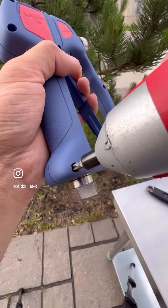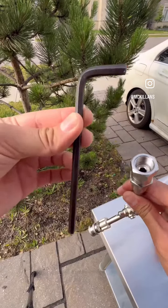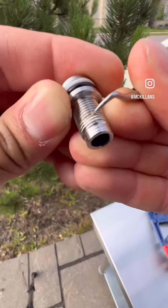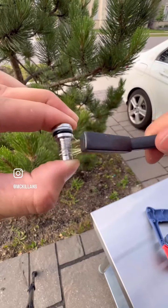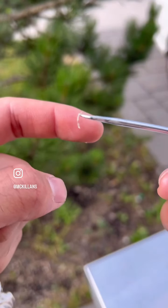To solve this, you'll need a phillips head screwdriver to go under the hood, and now we can disassemble the swivel using a six millimeter allen key and a wrench. Inspect the o-ring on the allen bolt and replace it if necessary. It's important to scrape off the old thread sealant using a pick and a wire brush, and make sure there's no loose debris left behind which can get stuck inside the valve mechanism.